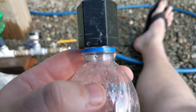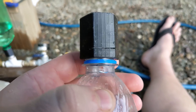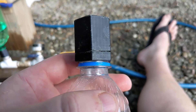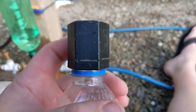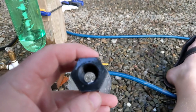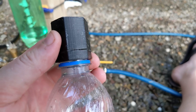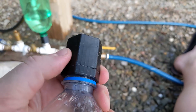The only problem is the screw threading forces kind of separated the layers, I think because I'm printing this a little bit too cold. So that was a backup — I printed the exact same as this one, and I have another one on the printer that has more mass to it, more cross-section area, and a little bit higher temperatures, so hopefully we get better layer connections.